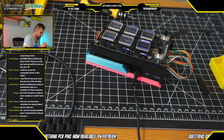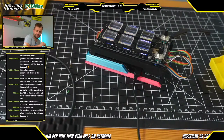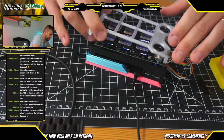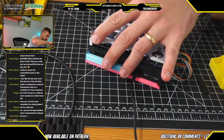And last one. Yeah, I kind of like these new PLA Plus filaments that companies have recently started selling. Not only do they have a really cool kind of pearlescent color, but apparently they also have mechanical properties that are more similar to ABS instead of PLA. So they have a couple different, or more expanded uses, I should say, compared to the standard PLA, without being more difficult to print.